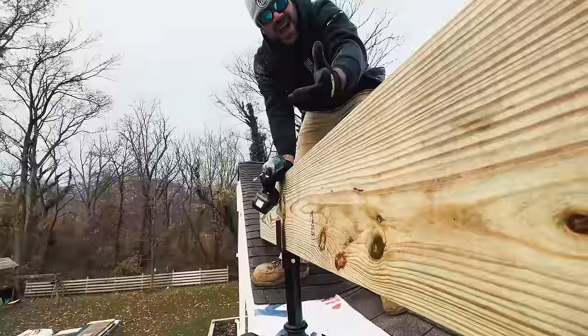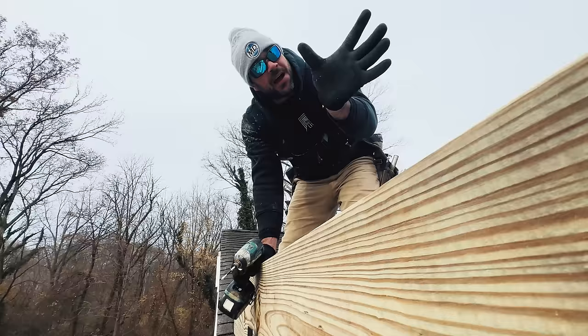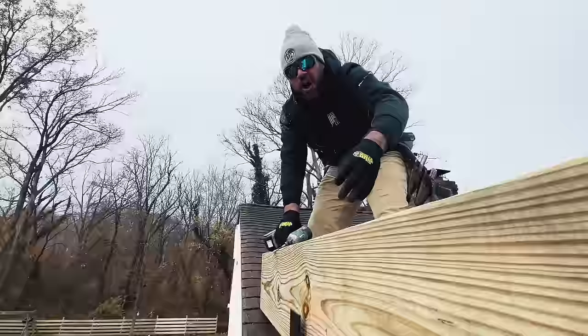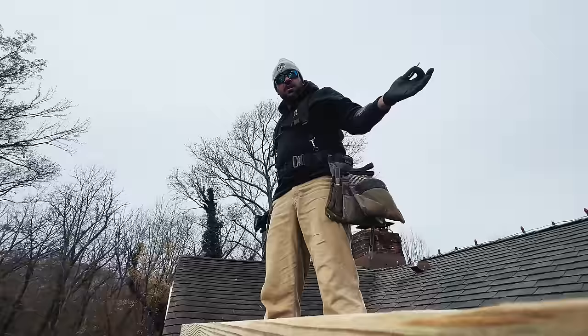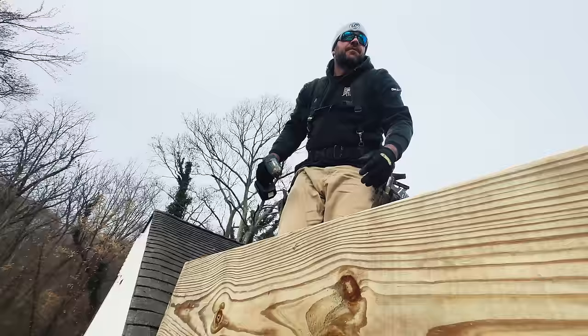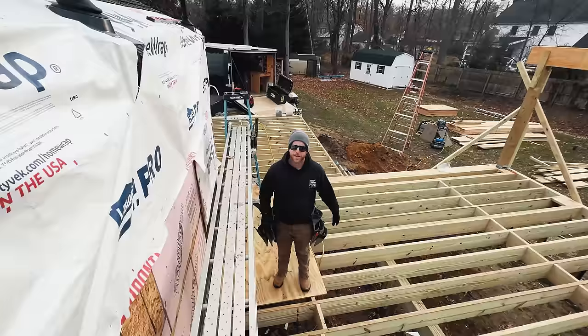Yeah. And real quick, all you people at home, he's framing with screws. I'm not framing with screws. I'm cinching these two plies together so I can get them nice and tight, and then I'll finish with nails. Calm down. And another thing, I'll just use a clamp. Who's carrying a clamp on their belt all day long? I know I'm not. I'm gonna use a couple screws, get it tight, and move on. Stop it. That's it for me. I'm done with that. Stop with the screws and the framing talk. Just watch and learn. Just let him go, everybody. He'll tire himself out. He'll be napping pretty soon at this rate.